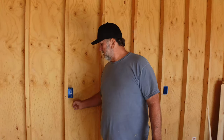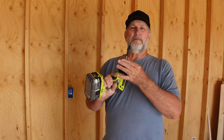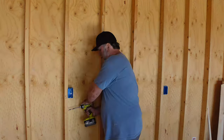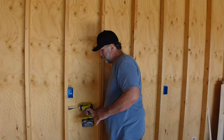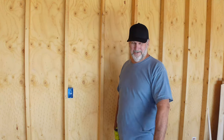For drilling the holes through the two-by-fours, I like using a spade bit like this. Unless you have an auger, that's fine too. But a spade bit is something everybody usually has. I use it in an impact driver and it works really well. You may not be able to use it afterwards, but let's go ahead and drill them so I can get the wires through. We'll skip ahead to the wiring in just a sec.